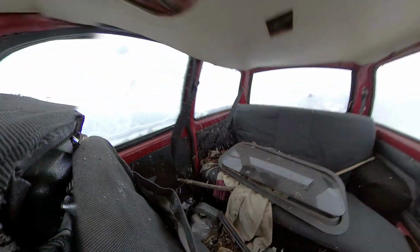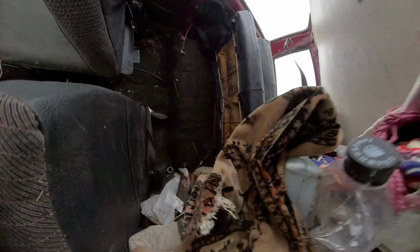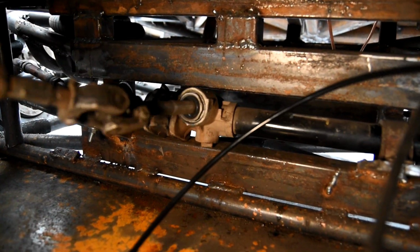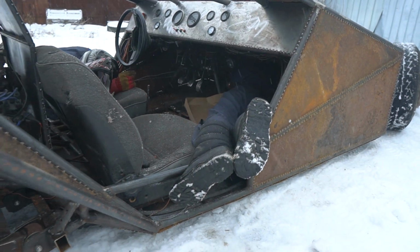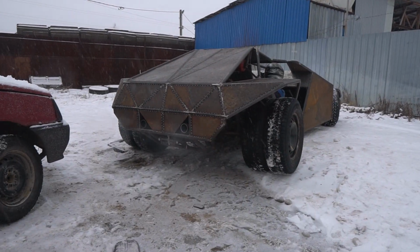The second time it got more confident, but still the wheels lacked the hook. There was a small breakdown as the steering rack flew off the clamp. In fact, just one clamp holds the entire rack from displacement. We need to weld several fixators to it and to screw it to the subframe with their help. We put everything in its place and continued the test.